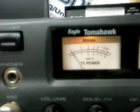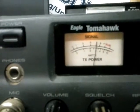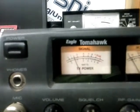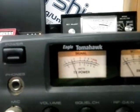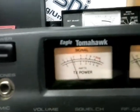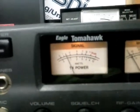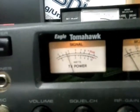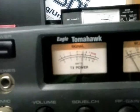Audio, audio. Yeah, swinging from a three to about a seven and a half. Oh yes! This amp is set up right, man. That's what I wanted to see right there. And I'm dead keying with the radio — I'm running two and a half watts driving the amplifier, dead keying 40 watts, and swinging about 65. Okay, that's good.